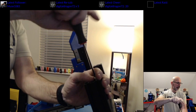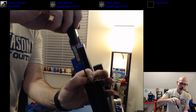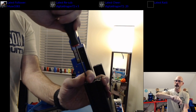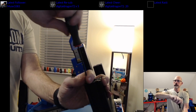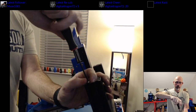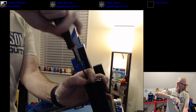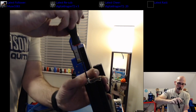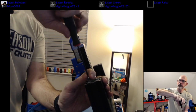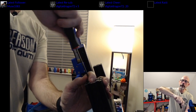Yeah, so I don't know if that was just bad threads. There's a couple of these that felt almost like I was about ready to cross thread and then they broke. So they might just have some burrs in them. But I just wanted to run a screw down through them. And if I sacrifice one of these, oh well. So I don't know if it's that or if my print is maybe just off dimension-wise a little bit, or a manufacturing defect or what, I don't know. I mean, it is a Creality machine base frame, so. Oh yeah, that one felt like it had a burr in it.